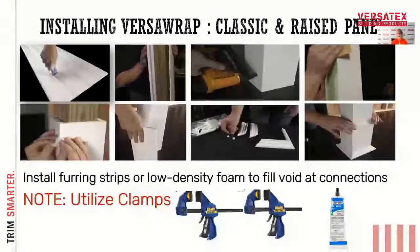These shots are just screenshots off a video that you can get to in the installation section of the website. All you're doing here is running a bead of glue down one side of two slots on the wrap and folding it up. I would say you want to clamp it at that point. Don't try to just pick it up and wrap it, but clamp it before you start moving it around. Use a low and high clamp, and one or two in the middle, depending on the size. You can let it sit if you want and then install it.